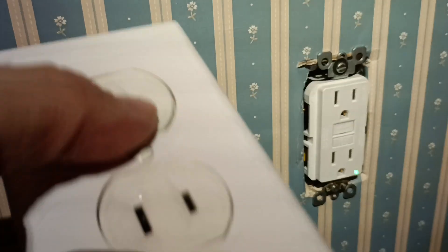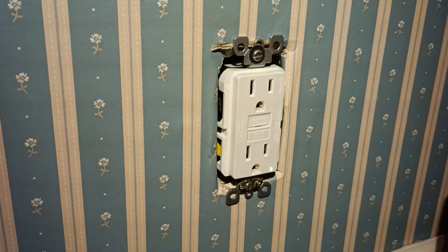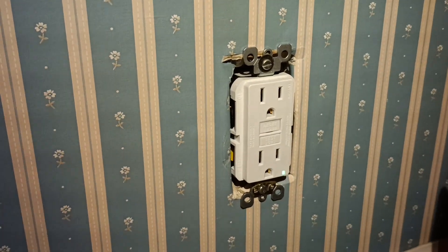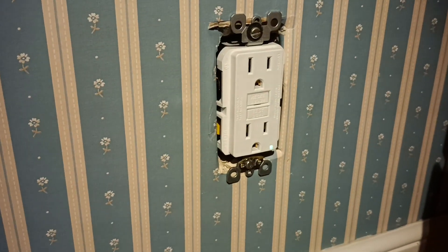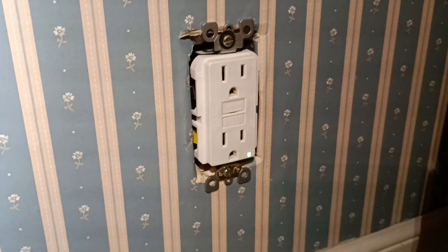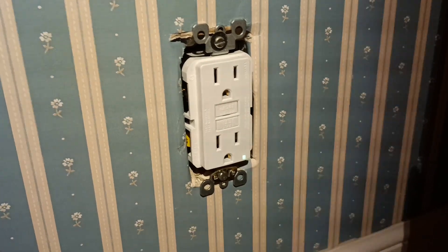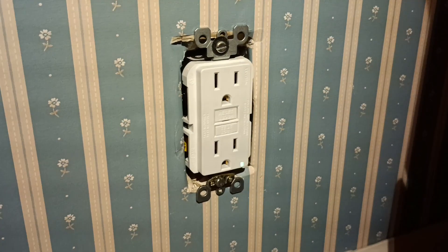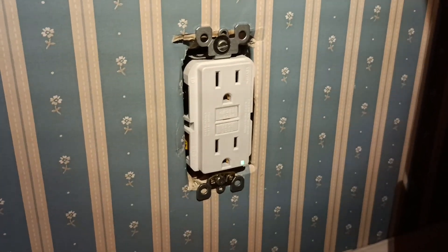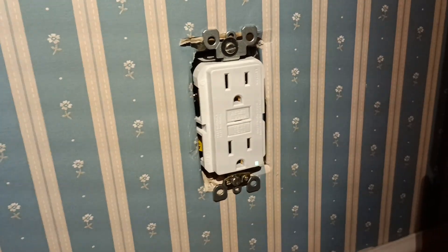If you're doing this because a plug was broken — say it had a chip in it — they do still sell two-prong outlets at Home Depot, Lowe's, places like that. They are more expensive than a regular outlet but still less expensive than a GFCI. So if you don't really need to replace or upgrade it, I wouldn't bother. If you're doing an update throughout the whole house, it's going to add up fast with GFCIs being about $20 a piece at every single location. That's how you do it — and that's how it's done. We'll see you on the next one.